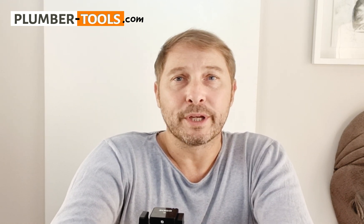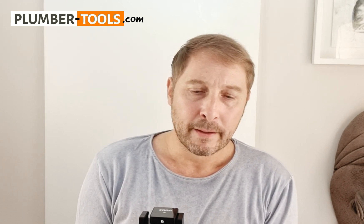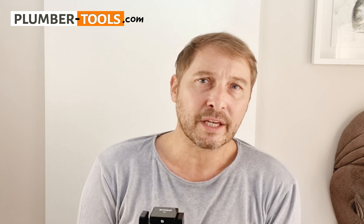Liam from Israel asks: what is the optimal working speed? The optimal working speed is between 1500 and 3500 RPM. Having said that, slow and steady wins the race versus fast and furious. It's not so much about the speed — it's about the quality of the chains. If your chain is a good chain, with a slower speed you can achieve the same result. The other advantage to going slower is that you stand less chance of kinking your shaft should it bite into something. For that reason, I would prefer to go with lower revs than higher revs.